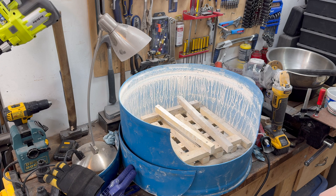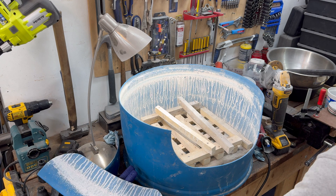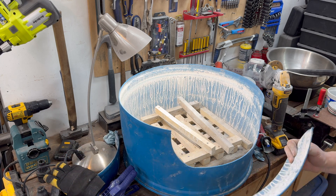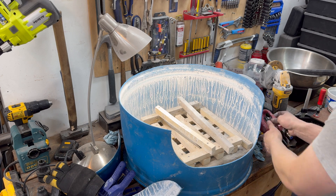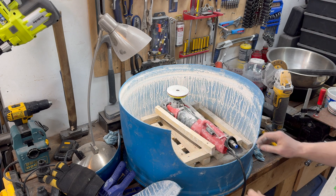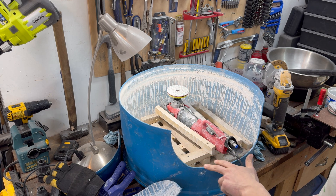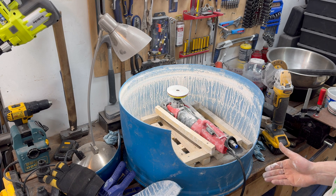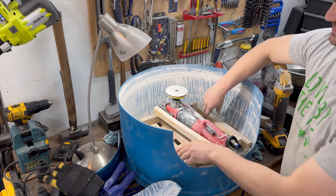For polishing, I have a 55-gallon polyethylene drum. It has been cut — it is approximately a foot, maybe 13 inches tall — and in the front you can see where I have cut out this piece, and that allows me to set the polisher in there. Inside the tub is a lattice made from one-inch by one-and-a-half-inch slats of various softwoods and cutoffs, simply made into a lattice that fits snug inside the barrel so it doesn't move around.